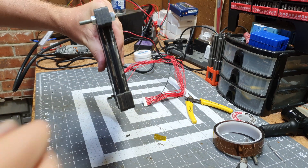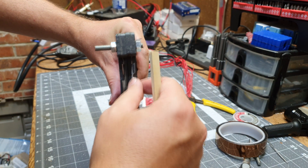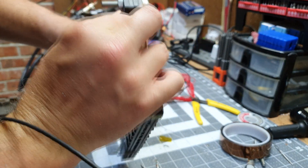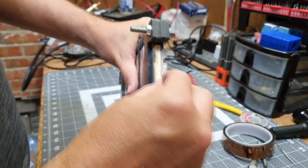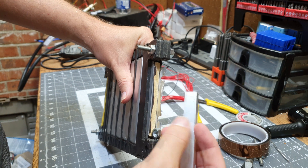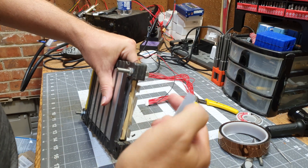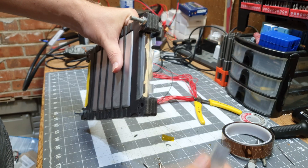I just want to stop in the middle of our time-lapse to show exactly what I'm doing. We've got the bridge between the two tabs — I've spread them out a little to give them some curl to push outwards. Got a quarter-inch wood spacer going in here, then quarter-inch 20 bolts to squeeze up to the side and pinch on the ends. We'll squeeze those down, pinch them on, and cover them in tape. Then we'll drill a hole in the top for the balance wire leads and go from there.